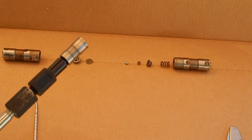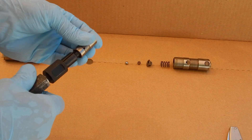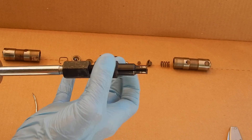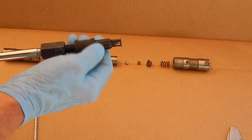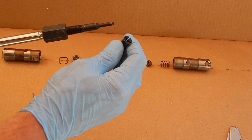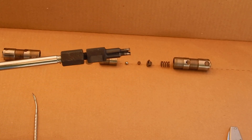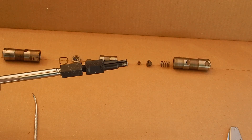It's worth it — I've seen guys banging on them, I tried doing that, it's very frustrating. This is a 10 millimeter collet and what it does is it expands when you screw this down. This here goes inside there and pushes on there, and it flares those out — that's how it grabs. Works very good. Like I said, I've never seen anybody else use this. I think one guy referenced using them but he never showed it, just talked about it in passing.